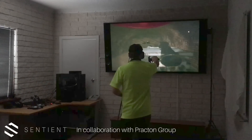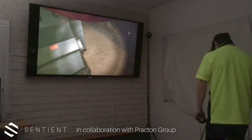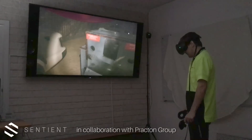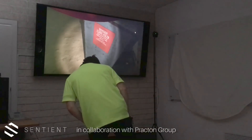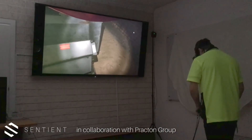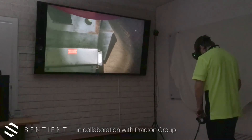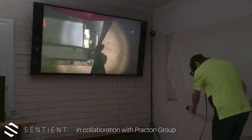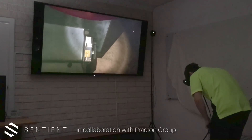These are the oil switches. This is called a ring main unit. It's in the middle of multiple ring main units, which all go around in a circle and connect back to each other. You've got a high voltage cable coming in on one side and going out on the other, and then it's teeing off at this ring main unit — through a switch, through some fuses, and then into a cable to a transformer feeder to power a switchboard and run your plug.